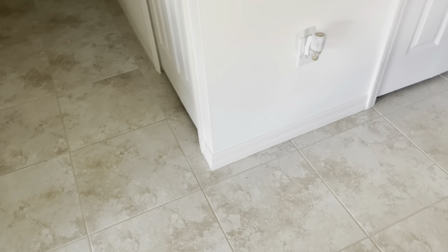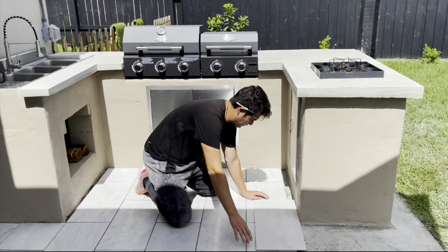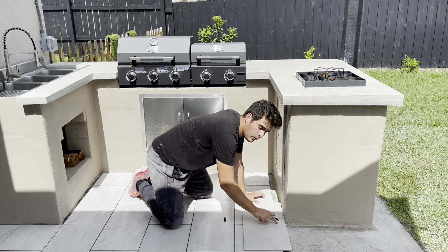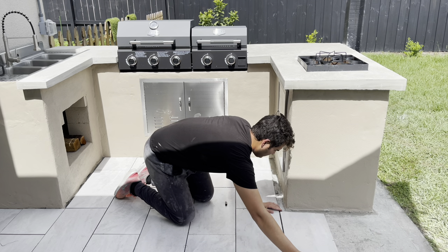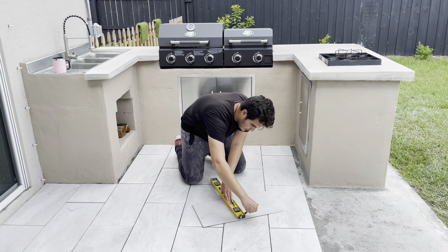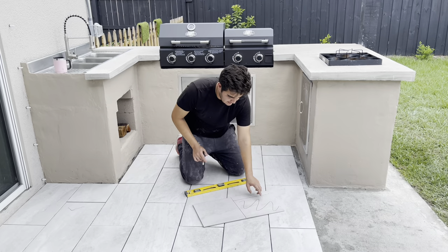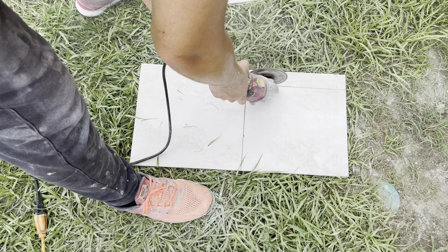We wanted to show how we decided to do our tile corners outside. Looking at the inside of our house, we noticed that every corner the tile wraps around. Unfortunately our mic was not working in this part, so we're explaining after the fact. To make corner cuts, place the tile approximately where it will go based on the previous row and mark where the cut needs to start. Place the tile on the other side to get the height of where the cut needs to be, then make a connecting line based on your two points and mark the waste side. Since the tile cutter cannot make these cuts, we used our angle grinder. You can also use a wet tile cutter — cut very slowly to prevent cracking.